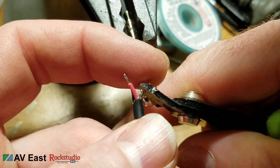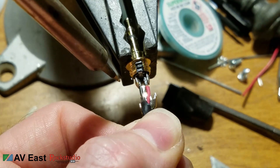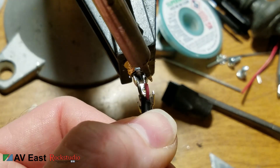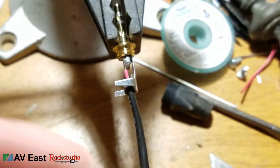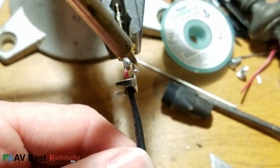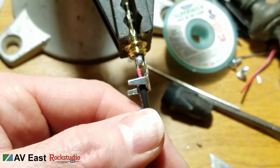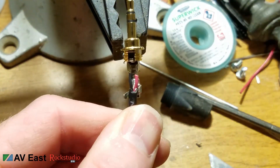You'll notice that the drain wire has to be trimmed a little bit shorter. Next, figure out the left and right contacts in the connector — on this one, the left side contact, which is also the tip, happens to be on the left. Arrange the conductors of the cable so they line up with the contacts of the connector — it's the four C's of making a cable. Very carefully solder the conductors to the contacts. For the 3.5mm connector I'm using a really small needle point on my soldering iron. Soldering the drain conductor to the connector is the most difficult because it's really small — I wet the tip and heat up the whole bottom, then push the conductor in via the cable itself.